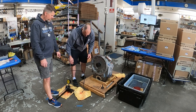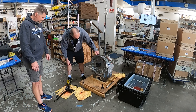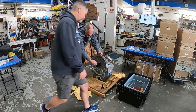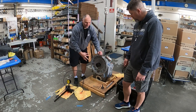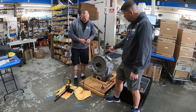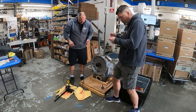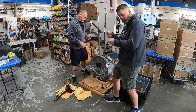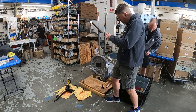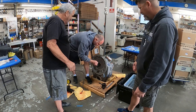We use this special tool here — it's called an SKF tool, very high pressure. We're going to put so much pressure inside those little veins around the taper that it'll actually expand the whole coupler and pop it off the input shaft. Once you take this hub off, you'll notice there are small grooves in that tapered shaft that allow oil to get in under very, very high pressure, which allows that hub to disengage from the taper.